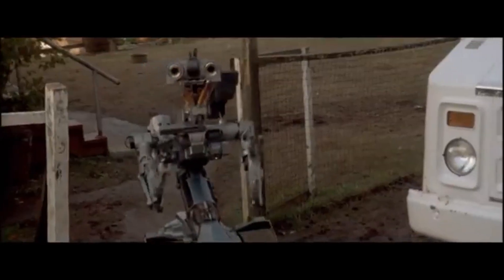Disassemble! No disassemble! I'm going to see what I can do to try and improve the guiding. I tore it apart when I first got it — when I put the OnStep controller on it and put the belts and pulleys in. I tore everything apart except for the bearings; I couldn't figure out how to get them out since they're pressed in. But now I have an idea. I know a little more about mounts now, so I think I made a few mistakes. This time when I get it back together I'm going to spend a lot of time on the two worm gears, try to get the backlash down to nothing hopefully. So join me for better or worse.